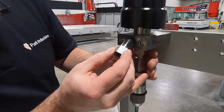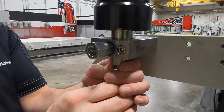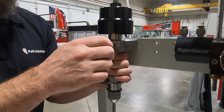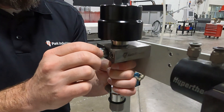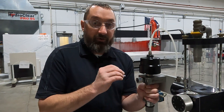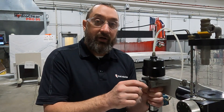I'm going to start my adapter in here and push that bullet towards that valve body. The cutting head sits up just a little bit, so I'm going to raise that up and wait until I can just feel that bullet touch that valve body — not putting hard pressure at all yet. We need to make sure that bullet seats tight into that valve body and is perfectly centered. Can't stress this enough: it has to be centered. If it gets pushed in crooked, it will wreck the parts and you will have to replace them.